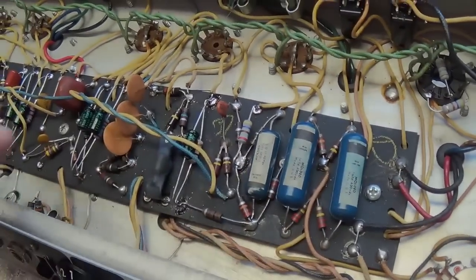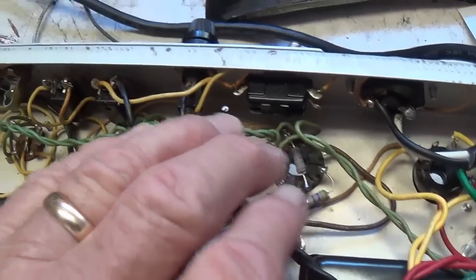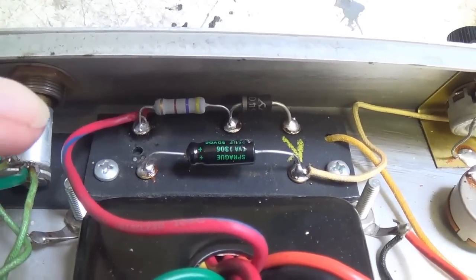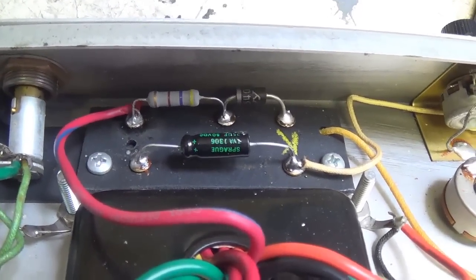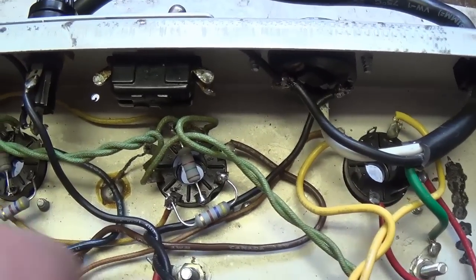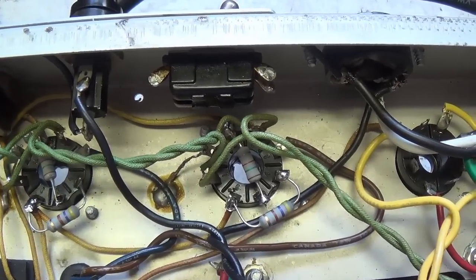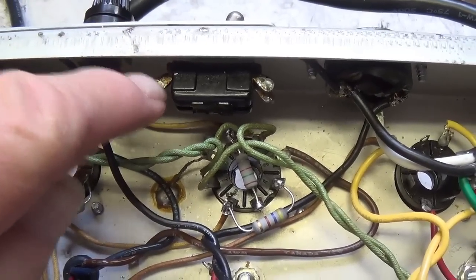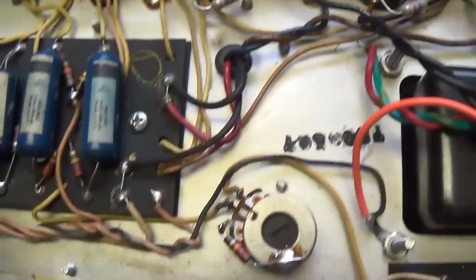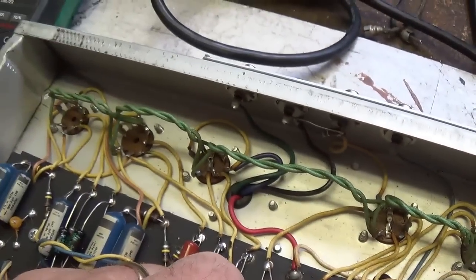Now, with all the resistors tested and the bad ones replaced, it's time to rewire the primary circuit. The negative DC bias supply has been overhauled, and the primary winding has been rewired in a more appropriate circuit pattern. The final step will be to convert the polarity switch into a negative NFB loop. Then we'll be ready to plug in some tubes and start audio testing this gem.